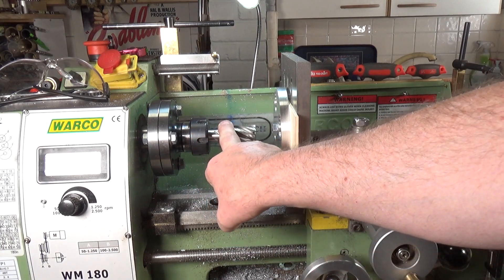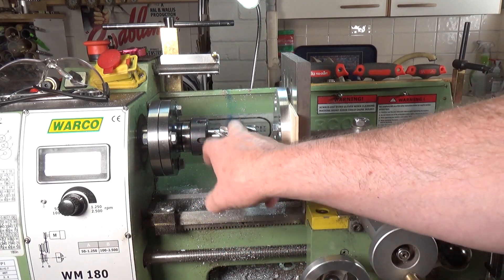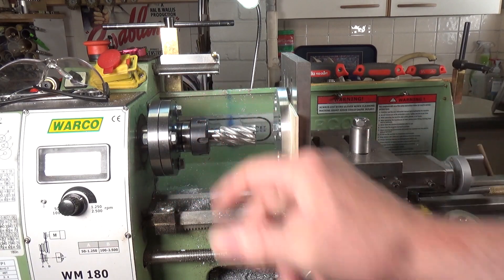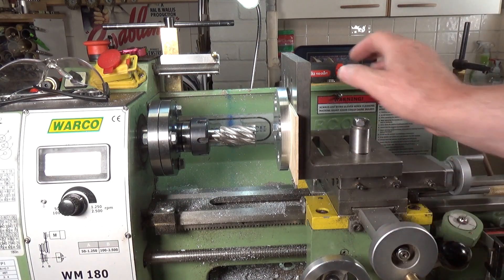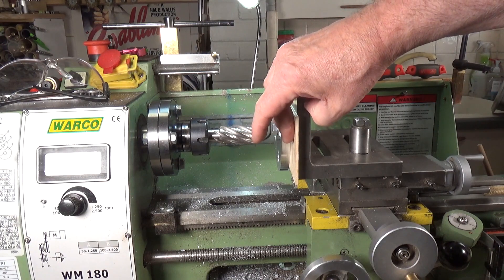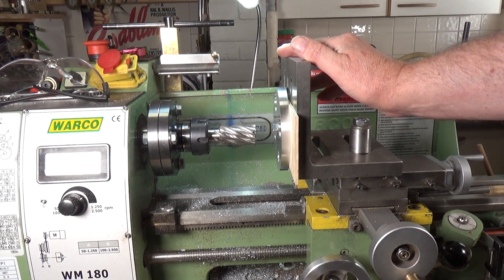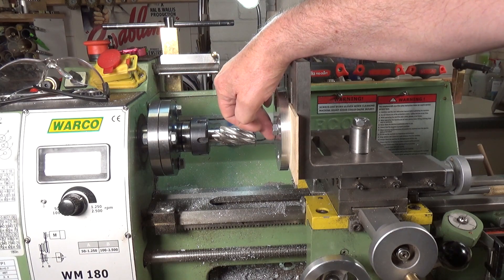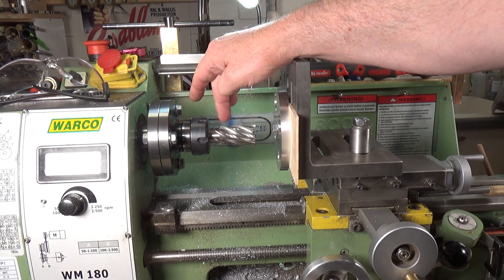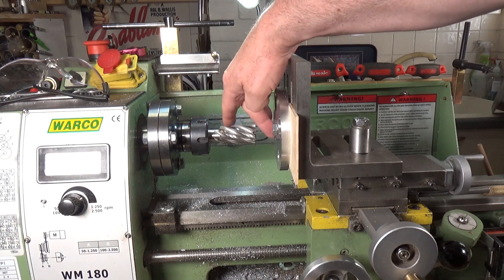We have a one inch end mill in a collet. This is a pretty heavy tool for this little lathe, so you really have to feed it nice and slowly because you don't want to put too much load on it - it's not really designed for this kind of work, but it does work. I have an angle plate bolted to the tool post and the work is bolted onto the angle plate. The piece of 3mm plywood behind the work is so I can go all the way through with the hole without cutting into the angle plate. To line the cutter up, before putting the cutter in I put the original drill bit in another collet and line the plate up so the drill bit slides in and out of the hole that's already there - that centers it up.